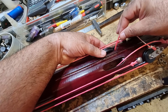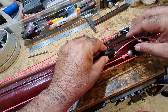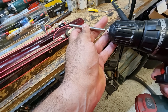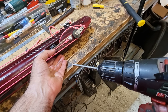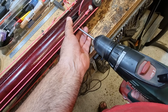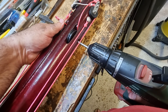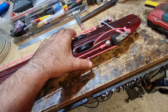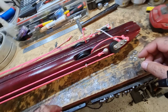We put this back in carefully, making sure that the line is in the groove, and we let it drop — same goes for this side. We take our pin, put it on the drill right at the edge if possible. We pick up our alignment. We do this because it has to be snug. Then we go into the other one, and the last bit we can actually hammer in just to be on the safe side.